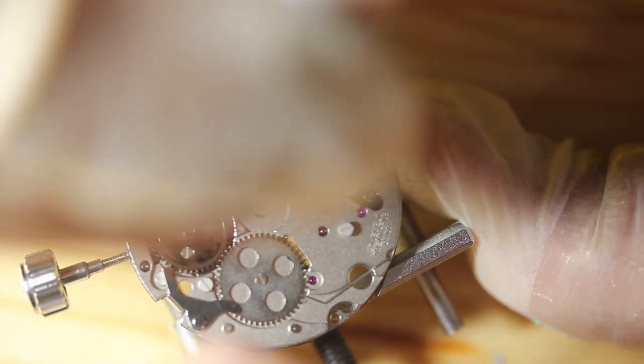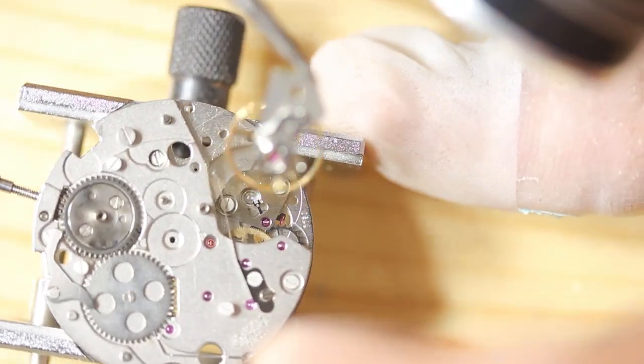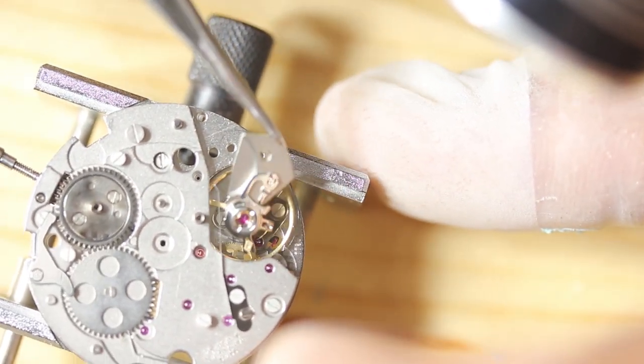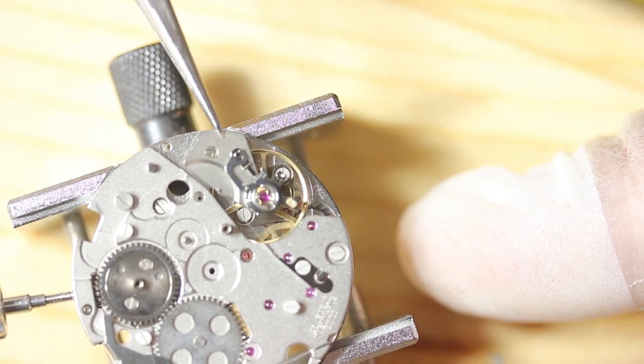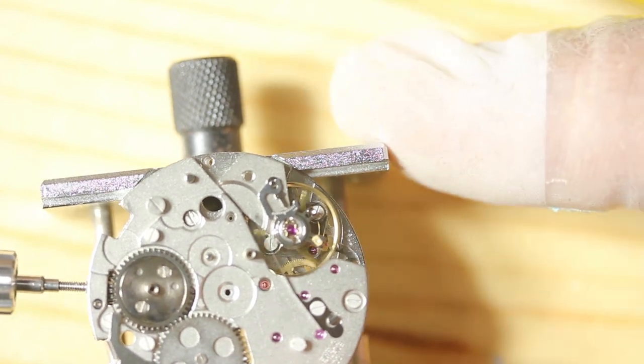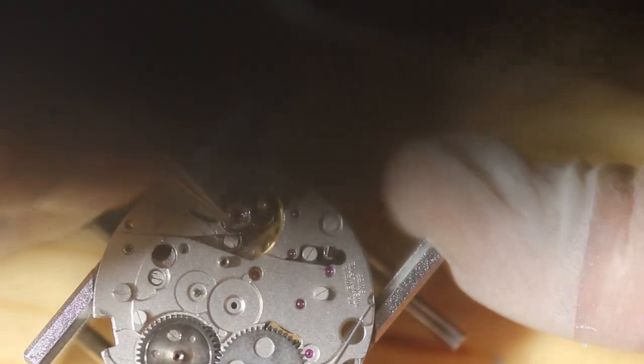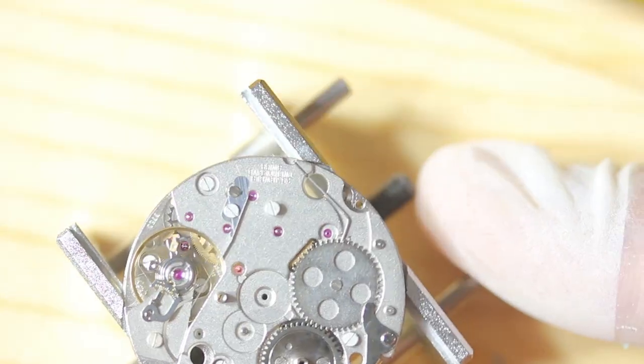Applying some 9010 on the pallet fork. Cleaning up with Rodico and installing the balance wheel to see if the watch has any heartbeat. And yes, it does. Now we can start putting the balance screw. Removing the Incabloc jewel,